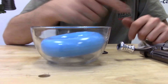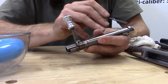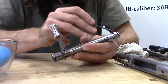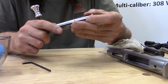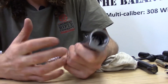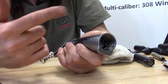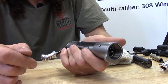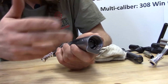In the action, the contact will be along an arc that bisects the bearing surface of each lug. Under load, the lugs will be elastically flattened against the receiver and vice versa — the bearing surface of the receiver will flatten against the lugs — and that area of contact increases and transmits load.